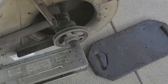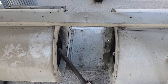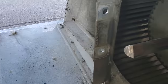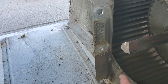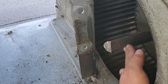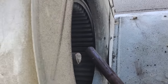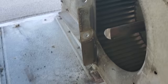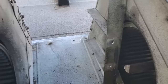Got everything cut - they're all broken free so I can unbolt everything. We're going to flip the blower assembly over. What I did to cut this out was use my angle grinder and make side cuts, that way I could still keep it within the blower wheel because the cuts need to be positioned so you can still drop it out the bottom of the blower assembly. Just two cuts - one that way, flipped it over, one that way until they met. But you've got to make sure that everything is the right stuff before you do that.